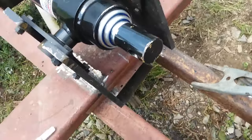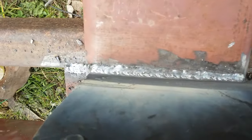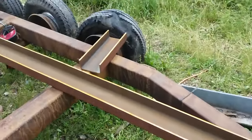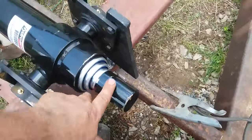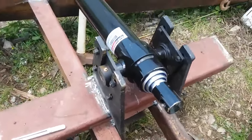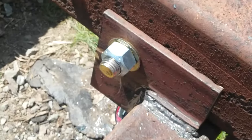The first weld was under amperage so I tripled it up - not so pretty, but I welded both sides. That's the cross piece - the ram will obviously mount down below in the brackets. This whole assembly turns, ram stands straight up. I gotta weld the ends back on, square everything up, and mock it up. I still need to pick up a bolt - the pipe I was using was heavy gauge but by wiggling things around I actually bent it, so I ditched it. Weather's starting to roll in here so I might just call it for the day.